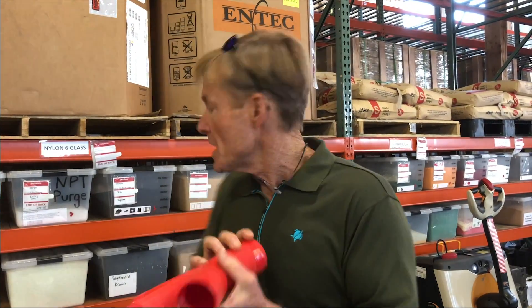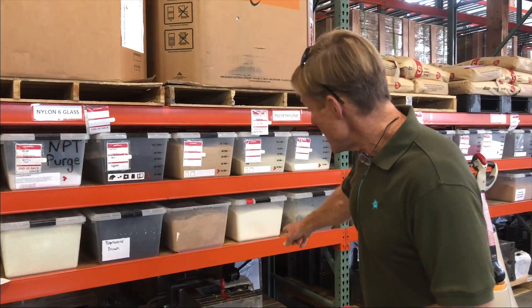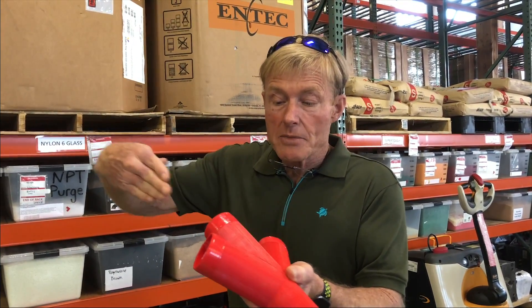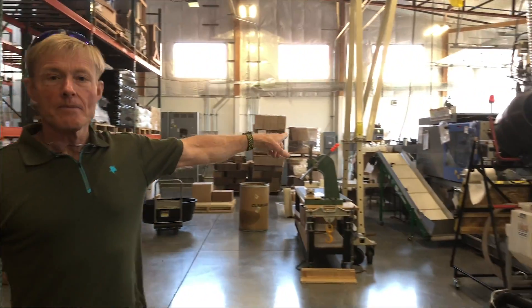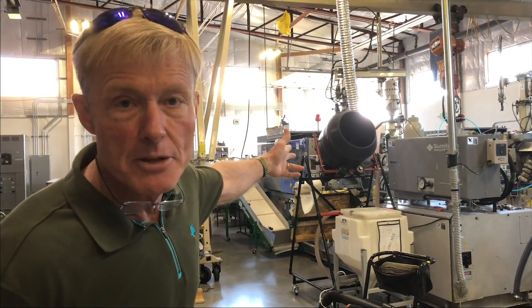The problem with a one-piece mold is these holes all the way through — you'd basically need four mold blocks that come together and meet. When the mold is in the machine and reaches the end, it has to open up and drop the piece out. That would be ideal, but then the mold gets really big and the machine here may not handle a mold that size. The mold maker would do it in CAD first and then we'd see if it fits in a machine of this size.